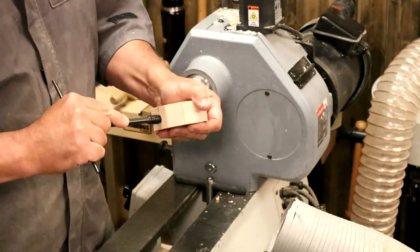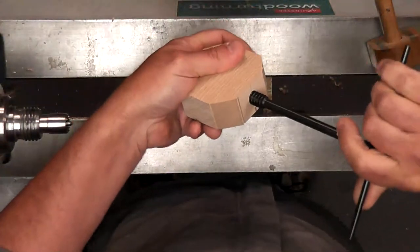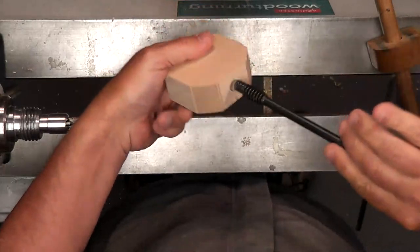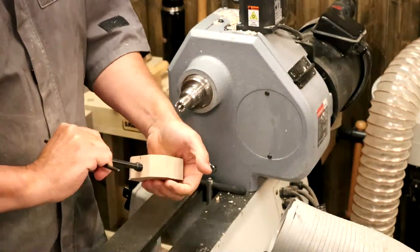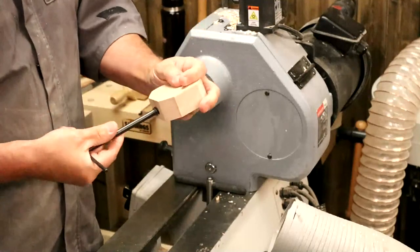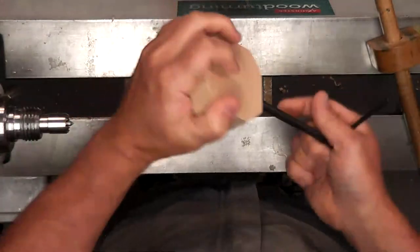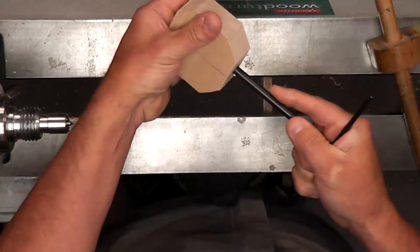It's that easy, and immediately it'll start cutting. You want to keep it clear, like you would with a normal tap and die set if you've any engineers there, you want to keep the swarf clear. Makes one of those really pleasing noises as it cuts. And it's just going to get to the bottom of that blind hole, and I won't be able to go any further. Little bit of wax in there if you get too much screeching, but there we are, that's the bottom of the hole.